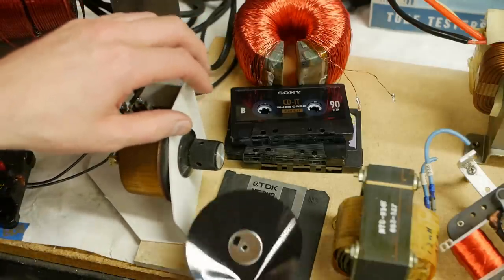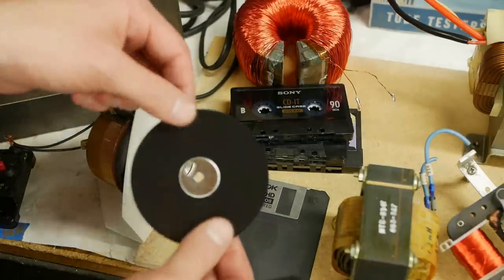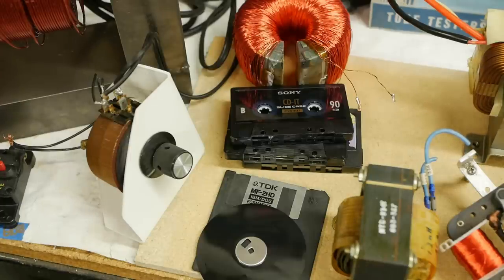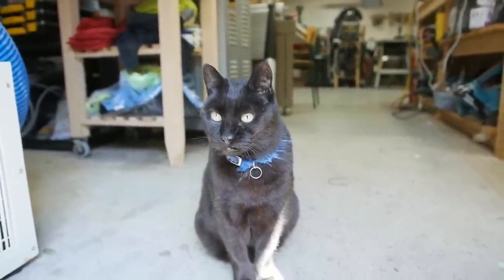For magnetic storage media we actually want a material with really high coercivity — we want to set the magnetic information and have it not change until we're ready to change it again. The permeability doesn't really matter that much in this case. Depending on what you're doing with magnetics, you search for a BH diagram that meets your need and make sure you're looking at that characteristic at your desired frequency. There's of course a lot more to cover, but I think this does cover all the key aspects of magnetic circuit design. I hope this has made sense and made it easier to get started. Once you start reading on the internet people will dump math on you, but keep things conceptual until you really need the heavy-duty analysis.